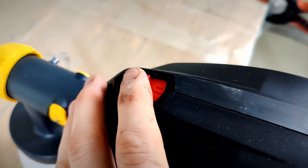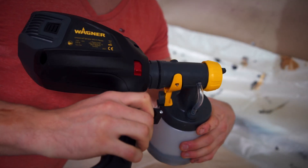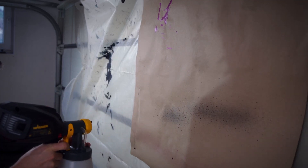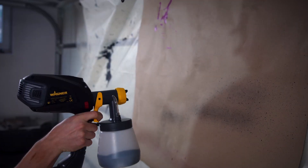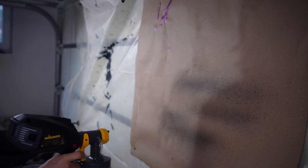According to the manual you should use less air with the lacquer attachment. I started with the air set to low and the lowest material feed possible, which resulted in blobs and uneven texture. I slowly increased the material feed, but this didn't atomize the lacquer finer — it only increased the paint output.